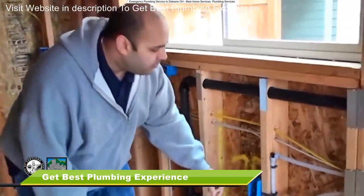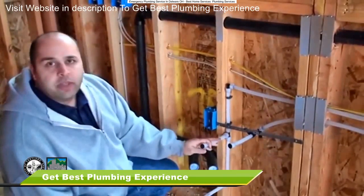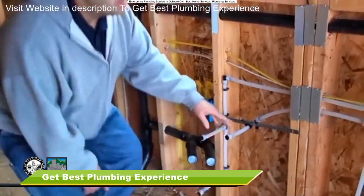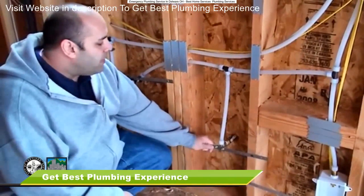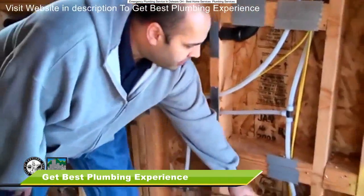So we come across here, we've got our hot side and our cold side. Hot's always on the left. We've got our supply for our sink, our supply for our dishwasher, our cold water supply for our sink. We come back across, we've got a hose bib that's tied in to the system. This strap right here secures that for maintenance and repair, so people will be able to work on that system. We've got our ice maker at this end.